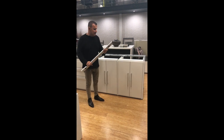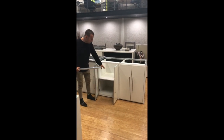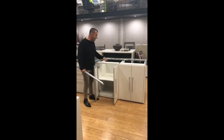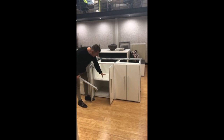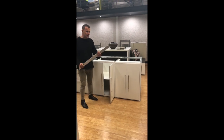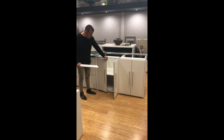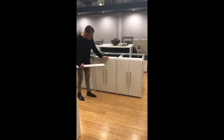I'd like to talk about our cabinetry. Fresco Frames uses a range of different materials in the construction of its cabinets. On the internal we use a 15mm PVC material which can be hit by water 24/7. We use it only as a lining — not structurally, since PVC is soft — giving you a total dressed cabinet with adjustability for a shelf base and two sides. Our doors are made of a quality aluminium profile, giving you the flexibility to have your outdoor kitchen totally exposed to the elements, with soft close features typically found in an indoor kitchen. The system allows us to offer a range of colours in the aluminium frame.